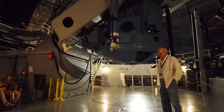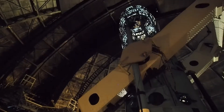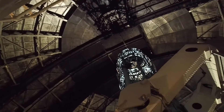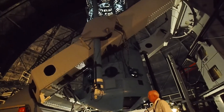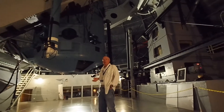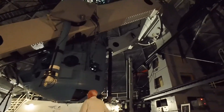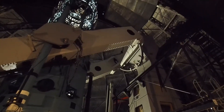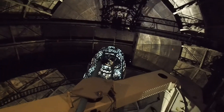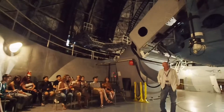The mirror, when figured, weighs 9,500 pounds. Originally the surface was silver. The moving part of this telescope weighs 100 tons, and you can see it's all put together with rivets. The telescope is supported on a mercury float — there's mercury here and mercury up there — and that holds the weight. The design is called an English yoke, which is very sturdy and very vibration-free. It does have a disadvantage, however, that we cannot look at the north celestial pole with it.